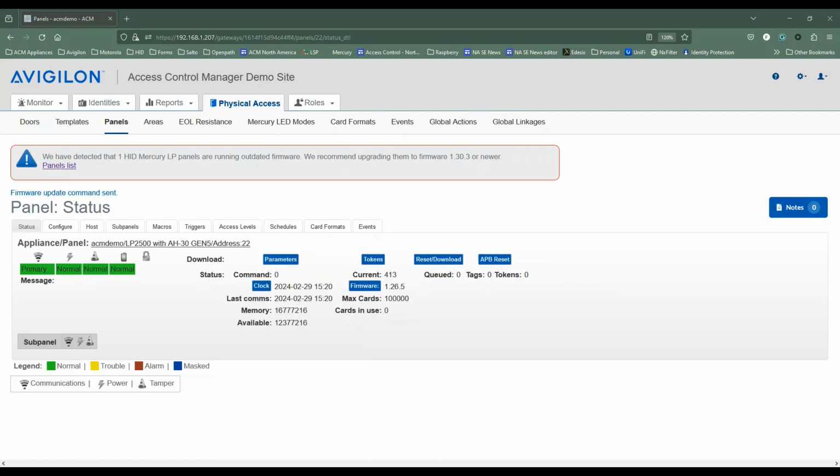I just noticed something interesting here. I waited a few minutes, and the message saying download firmware in progress went away. But I can look at the lights on the controller, and it's still going through the update process, adding the blocks of software, the firmware version, into that controller. So we want to wait until it reboots, and you will see a change in firmware version over here. So don't do anything. Although the message here disappeared, don't do anything to it. Just let it sit here until the version changes. I'll come back as soon as I see the change in version over here.